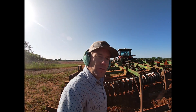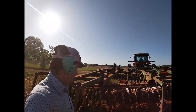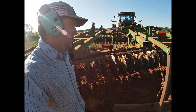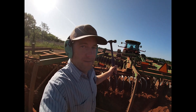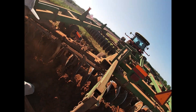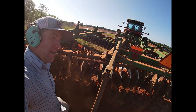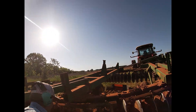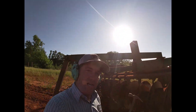Got a little bit of moisture out here where I was harrowing. When you have moisture, sometimes your harrow gets stopped up like this. The way we're gonna stop that — I do what's called ringing the bell. I'll come down here and knock the dirt off every one of these discs, then I'll get in here with the claw.